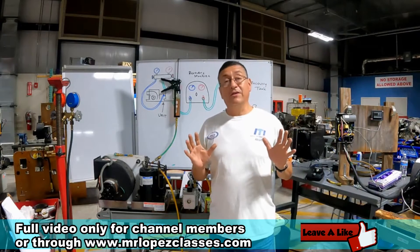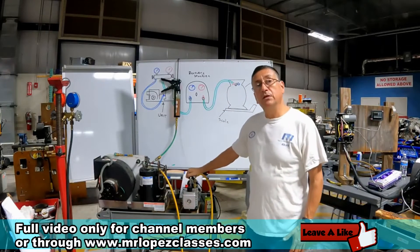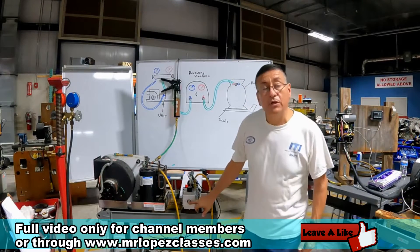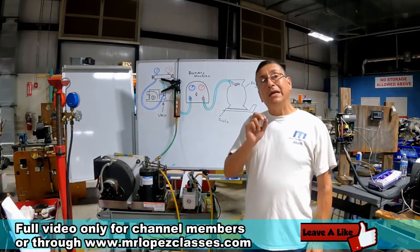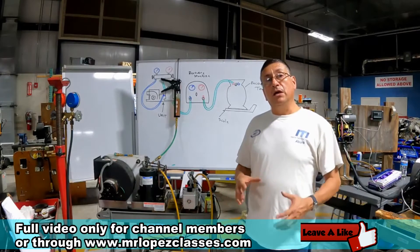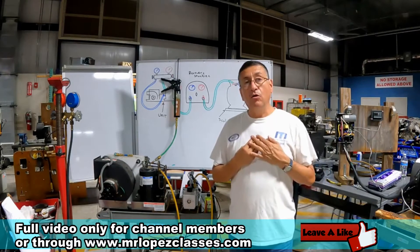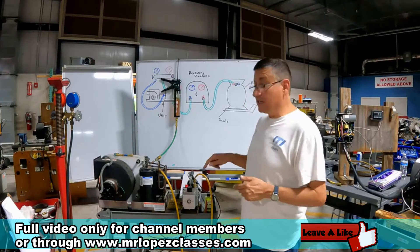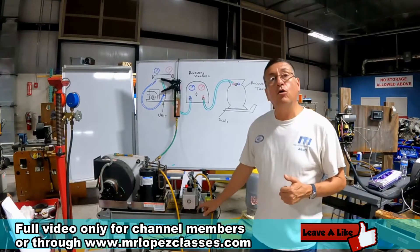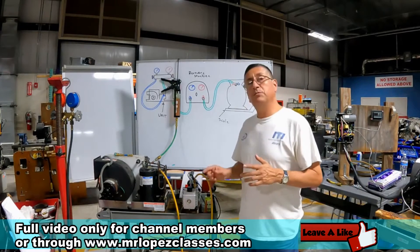Now we are going to do the process for the vacuum. In order to do the vacuum, we need the proper vacuum machine. This is the vacuum pump — it's a two-stage pump. This pump is important. The quality of the oil matters: the oil should be clear and transparent, and it should be at the level recommended by the manufacturer. If you see that the oil is a little yellow, I recommend replacing it with fresh oil — the oil recommended for that specific pump. You drain from the bottom, replace the oil, and keep the oil in good condition.